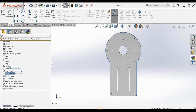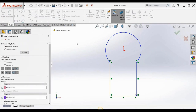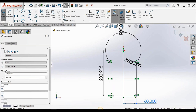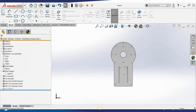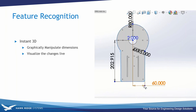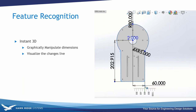Opening the base plate sketch, it's under-defined with all blue lines. Under Display/Delete Relations there is the Fully Defined Sketch command — I can choose which relations to apply and set origin locations for dimensions, and SolidWorks will fully define the sketch, giving me all the parametric control I expect. I can then use direct editing techniques like Instant 3D to reposition or reshape components — for example, shaving a bracket slightly thinner so I can put markers on it for videos, then easily produce a drawing.